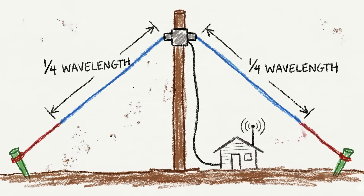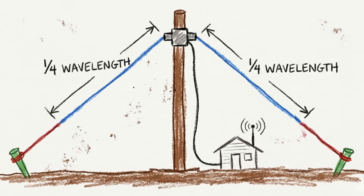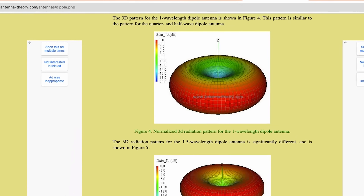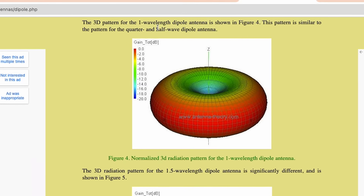Here's a simplified diagram of a dipole. It's also made up of a half-wavelength of total wire — roughly the same 66 feet for a 40-meter dipole — but with a quarter wavelength going in one direction and a quarter wavelength in the other. There's no transformer or loading coil needed. Unlike an end-fed half-wave, it naturally has about 50–70 ohm impedance to make your radio happy. The dipole is a great reference because it's naturally very efficient, meaning you barely lose any radiated power, and it has a very predictable broadside radiation pattern. A lot of people love dipoles for the simple fact that it's really hard to do better, and they're so simple.